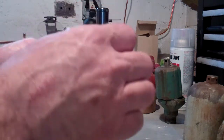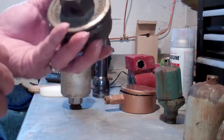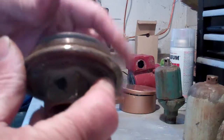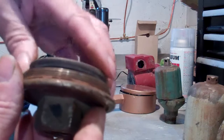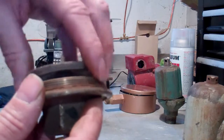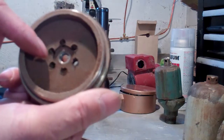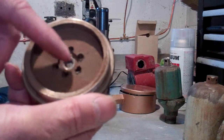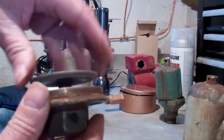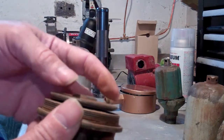I'll flip it upside down because there's a piece that's going to fall out. You can look inside and see the holes that the air goes through and that steam will also get into. There's a thermostatic wafer — the same thing that's in a radiator trap. A Dunham radiator trap would look nearly identical. That thermostatic wafer has a volatile liquid inside. You can see how the holes allow steam to spread out onto it.